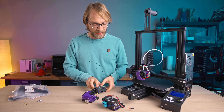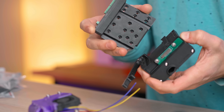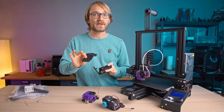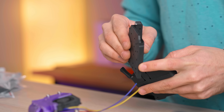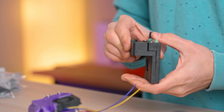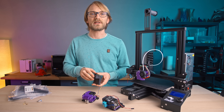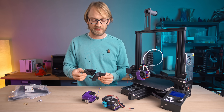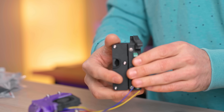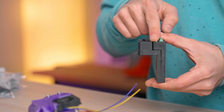As for the mechanical parts, they're all injection-molded glass-fiber-reinforced nylon plastic, which is solid, but the parts don't feel like super high-quality. They're robust and all, but they've all got pretty sharp flashing edges, and most of these parts are actually kinda crooked because of the way that they're designed — it's just big slabs of plastic. Plastic when it cools down likes to warp a good bit, especially right after it's molded when the entire part is still hot and deformable. So you get things like a bent release lever.